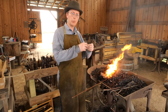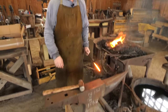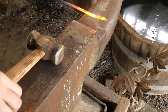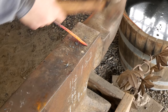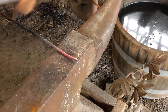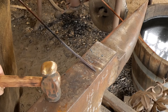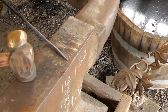We've got our steel hot — it's pretty thin so it heats up nice and quick. I'm going to put a point on one end; this will form one of the tines, and then come in and put a point on the other end. As always when putting a point on something, I want to come to the far side of the anvil with hammer blows right on the edge, going half on half off, in order to form that point. This is already pretty thin stock going into things like hot dogs and marshmallows, so I don't need an especially sharp or long refined taper.